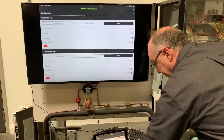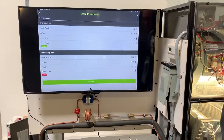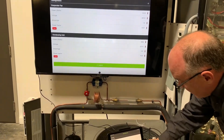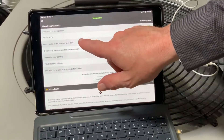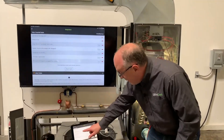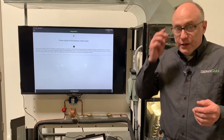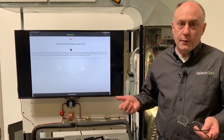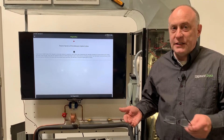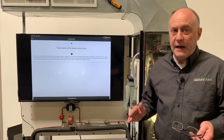I hit clear for the evaporator fan reading and now you'll see my power factor has dropped to about 0.58. I hit capture and go back to electrical diagnostics — it shows 'power factor in the blower motor is too low.' Tapping on that fault message reveals the diagnosis: a potentially failing run capacitor. In a real scenario you won't have a rheostat slowing the machine down, but if you saw this characteristic — blower motor running slow, power factor off — you'd go into TechLink and test the capacitor. MeasureQuick does top-level electrical diagnostics to help you along, even if you don't know what power factor means.